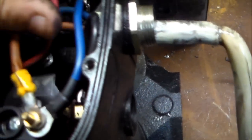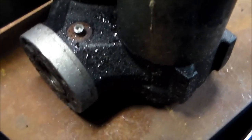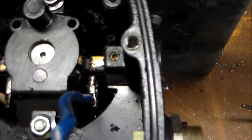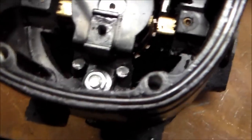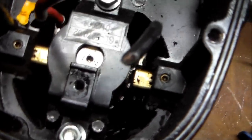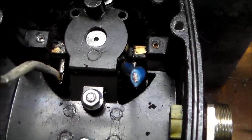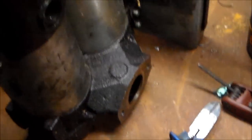Something I'll show you here is that the way these motors are wired, one runs forwards, one runs backwards. The reason they've done that is because one needs to run the opposite direction to drive the gear pump down inside there. I can already see this thing's done a lot of work — there's a lot of gunk down inside there, a lot of brush hair. Somebody's tried to clean that one out a bit, I think to fix it. But I'm guessing that the commutator bars are going to be pretty worn out.